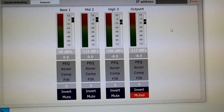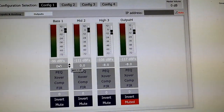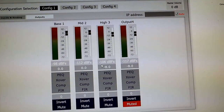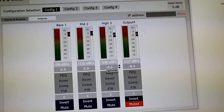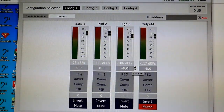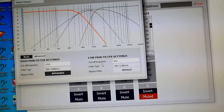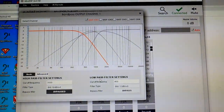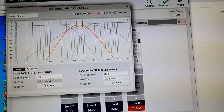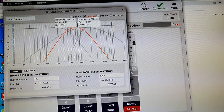For those that are interested — I'm holding this by hand — we've got bass, mid, and the tweeter/high. Both the 12 inch and the 15 inch are around 98 dB, so I'm leaving them at zero on the gains. But the tweeter is very hot at 106 dB manufacturer specification, so I'm trying to blend them to the same level — I've dropped that by minus 8 dB. The crossover, as per manufacturer specification, is coming off at 400 Hz at 12 dB slope on the mid — that's the orange curve — so the mid runs from 400 Hz to 1200 Hz at 12 dB per octave, and that just fills the gap between the two drivers.